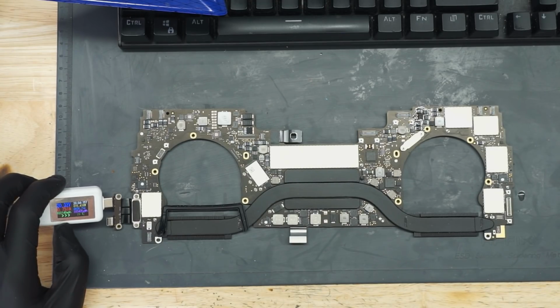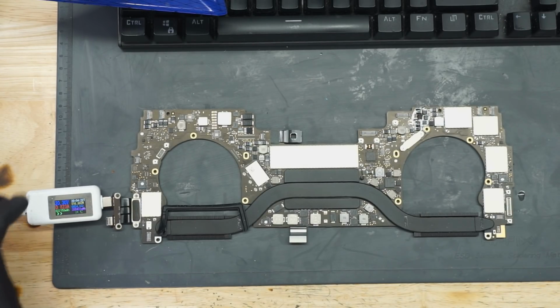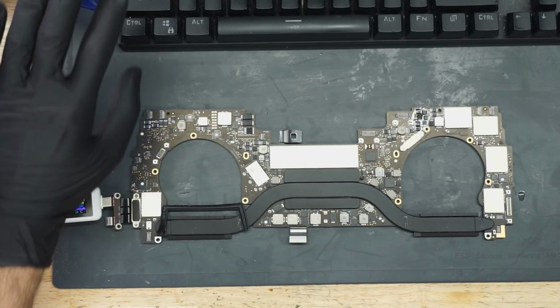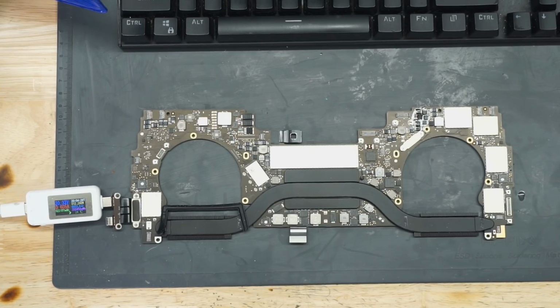But more important news, this board is working again. So as you can see, it's 780 milliamps. 780 milliamps are being taken. Our short is obviously gone. I don't need to measure it, Copaz. I just know. And that's what the cracked cap looks like. I'll probably add that to my wiki.